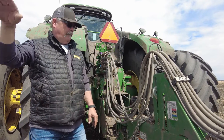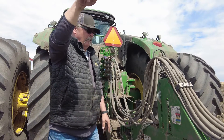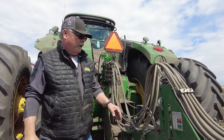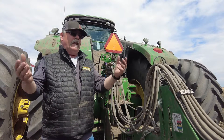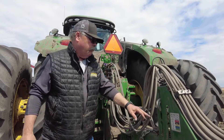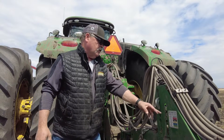Green is your front wheel lift up and down. If you look at the blue, that is for the rear basket or roller, whichever one you've got on it. Gold would be your mainframe lift — I call it the mast — fold it up. Black is your wing fold. Red is just your jack; you've got hydraulic jacks on them.